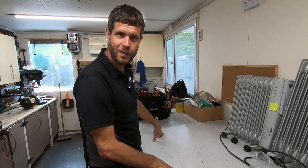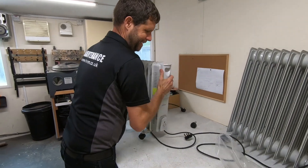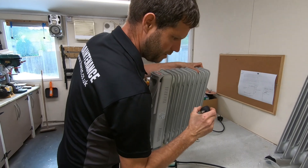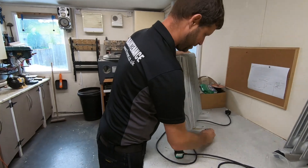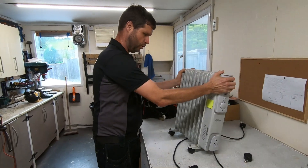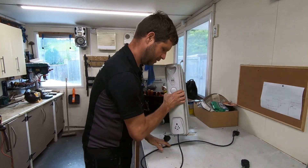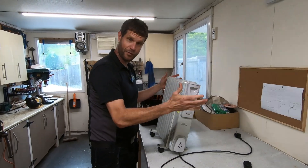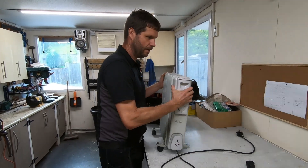The x-ray machine is all done. Now onto these radiators — we didn't even bother doing the PAT test on them to start with; these failed just visually. They both had one wheel missing. I've had to fix those — obviously they're not stable and could fall over. Not really electrical but still dangerous; they could potentially cause an electrical fault if they fell. Anyway, that's why we failed them. I bought some new wheels and we're going to try and get these repaired.